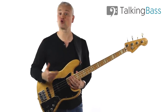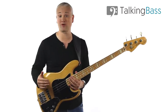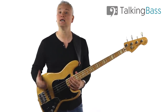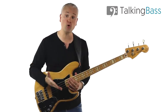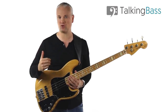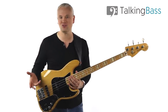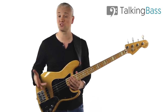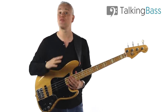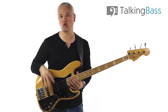On an active bass, that electrical signal comes out of the pickups in just the same way as on a passive bass, but then it runs into a powered pre-amplifier. This allows us to have all kinds of tone controls like we would on a regular bass amp, because we're supplying more electricity into the mix from the battery. Instead of cutting the tone, we can boost any frequency — bass control, treble control, mid control, and even parametric mid controls where you select the frequency required. Anything you might have on a bass amp can be fitted on the bass itself.